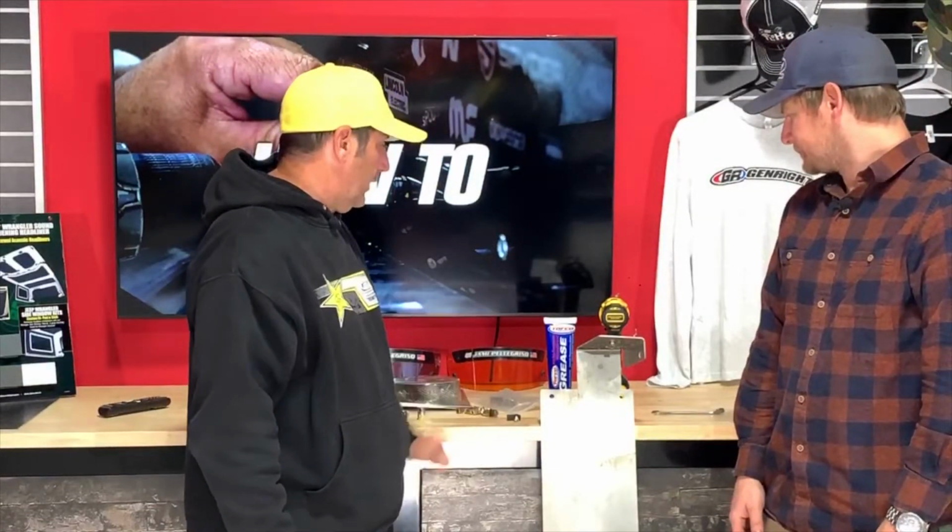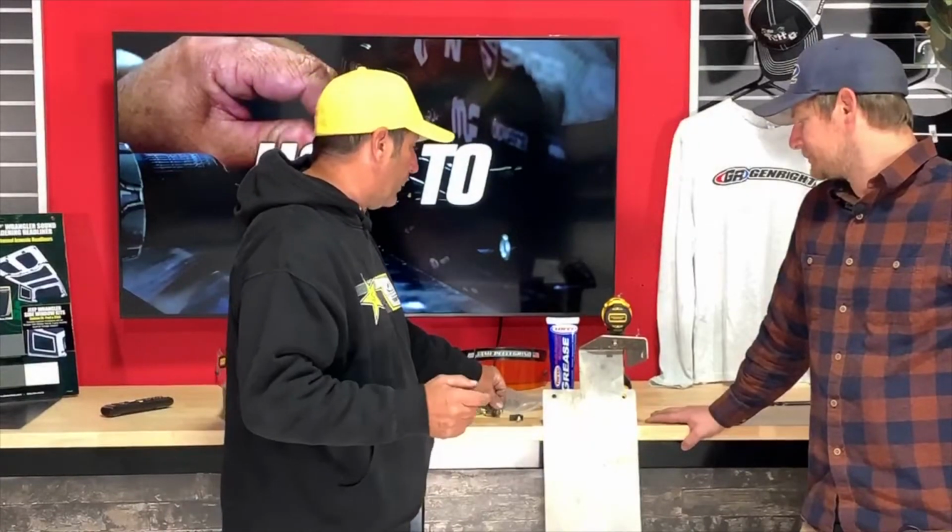All right. The one other thing I did want to add was on our corner guards and a lot of other products that we sell, we have this countersunk. This is called countersunk if it's got the little taper where it sits flush. Make sure that you grease these also with a little bit of grease. I kind of overdo it so you can wipe it up at the end. But what happens is when this head sits down in the chamfer, it really has a lot of bite to it, and this little Allen will strip out real easy. So a little bit of grease will give you that extra little oomph where you feel good that it's tight enough that it's not going to come loose. So we have those in a couple different sizes that we commonly use in all the products. So I just wanted to give everybody a tip on that too.